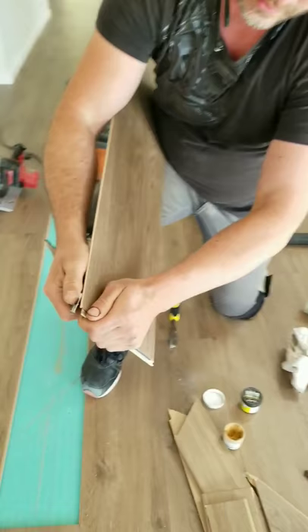I try to slide the board in. It almost fits — just a little bit more. It's easier here because we're near the end of the wall with just two boards. If it's in the middle of the floor with too much sliding needed, it's better to just cover the gap with wood putty and keep it as-is rather than shifting the whole floor.